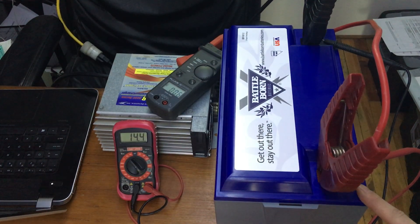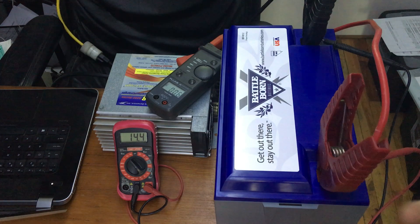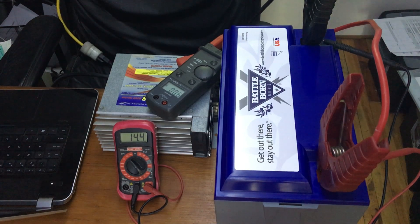The real test is what happens when the converter is turned off. When power comes in, it'll stay at a nice high voltage because it's full. When power is no longer coming in, it's very typical to see the battery drop a lot. With a lead-acid battery, if you pull the power off and it goes to 13.3V in a minute, that's pretty good; after half an hour at 12.8V is about typical. The rate of voltage decline is a really good indicator of battery health.